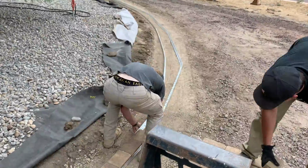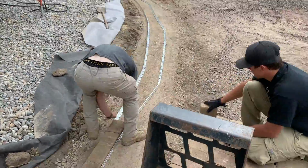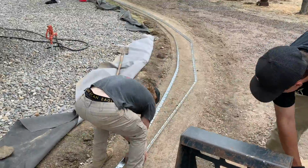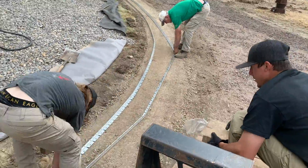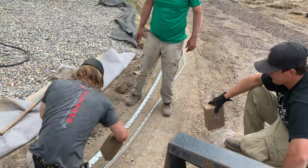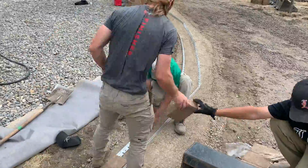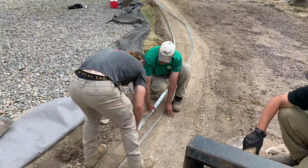You can see that we're placing these pavers on a nice surface. And what we had to do to get that is we excavated the soils and put a geotextile down on the subsoil, and then we compacted about 9 inches of base to give us a nice surface to tack into. We're actually not tacking anything in. You can see the guys, they're free-forming this. That way we can come back and get the shape and get everything true the way we really want it.